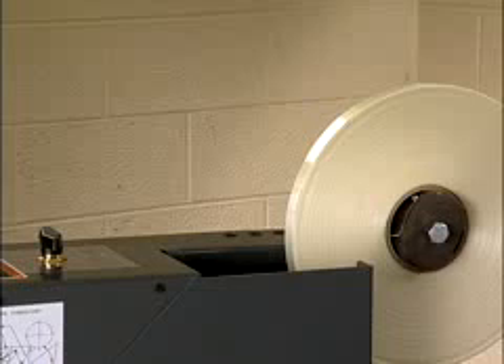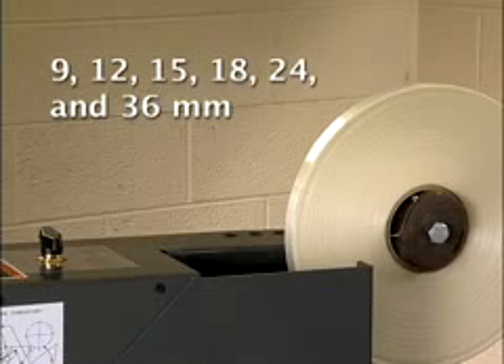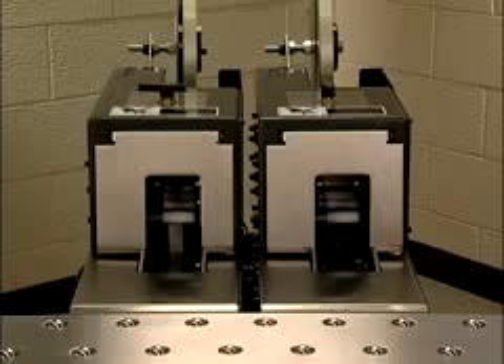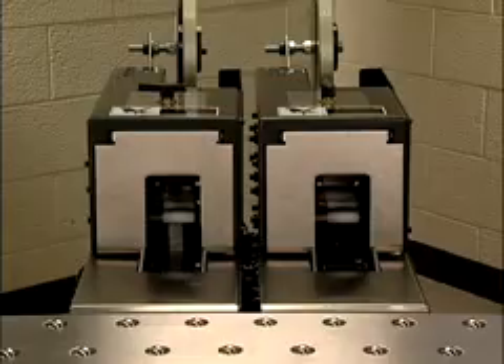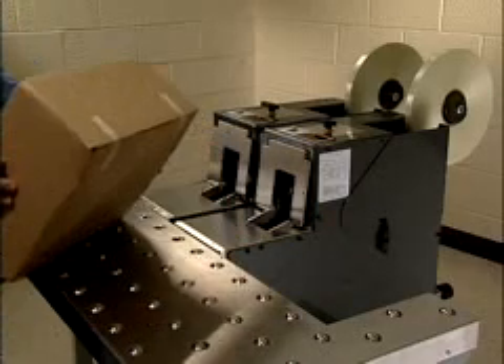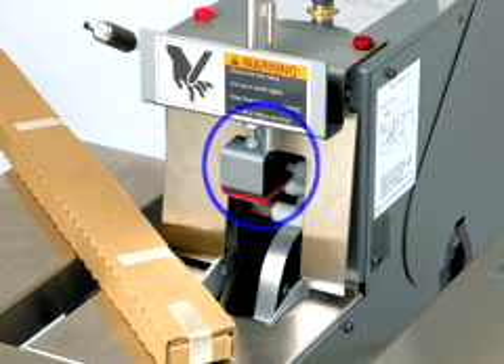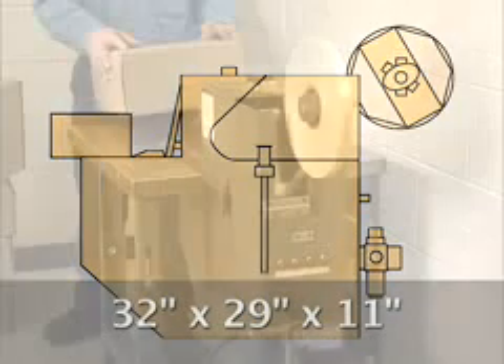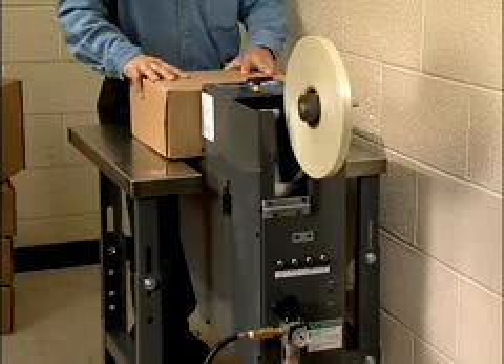To meet specific box requirements, use 3M tape widths ranging from 9 millimeters to 36 millimeters. When you need multiple clips on the same side of a box, taping heads can be configured side by side to simultaneously apply clips as close as 8 inches apart. To close low profile cases, you can add the optional U-Clip adapter for productivity and secure closure. A compact unit with a footprint of only 32 by 29 by 11 inches puts the applicator to work just about anywhere, even against the wall.